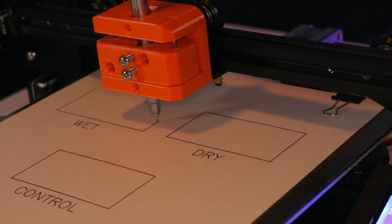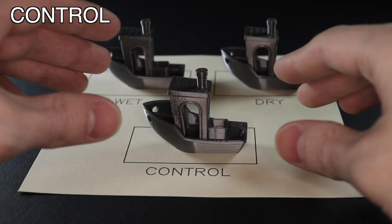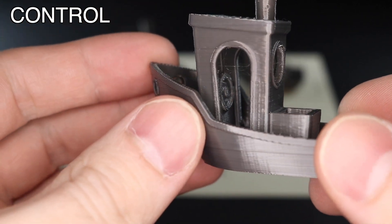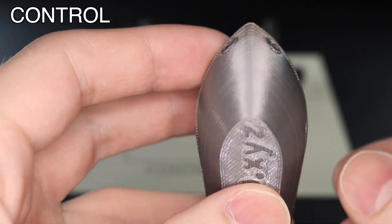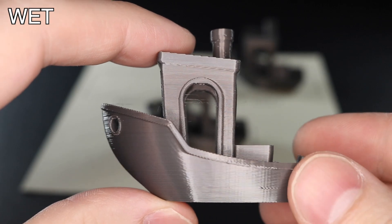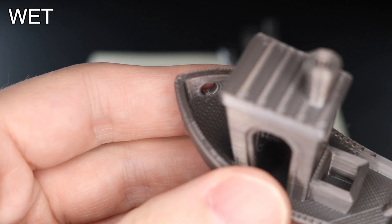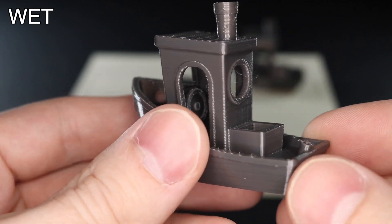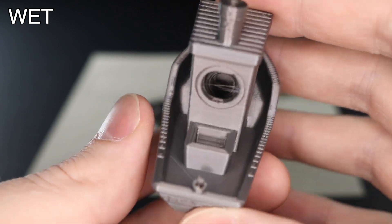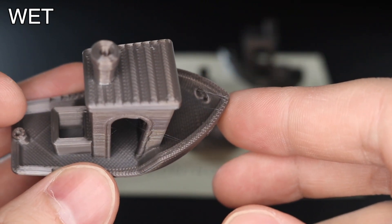The samples are marked on the bottom, but I still wanted a quick visual way to tell them apart. First up is the control sample — printed after the filament had been dried for 12 hours immediately after being removed from the vacuum bag. It looks pretty good, there's some stringing, and it's about what I'd expect for a PLA print on an untuned printer. Next is the wet sample — there's definitely more stringing present, but not a tremendous amount. This was the most surprising part of the experiment; I was fairly confident the wet filament would have a lot of print quality issues, but it looked more or less like the original control sample.